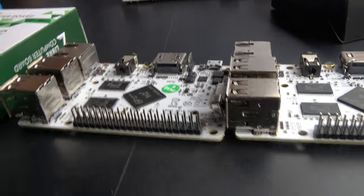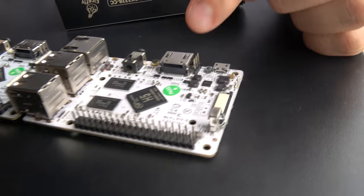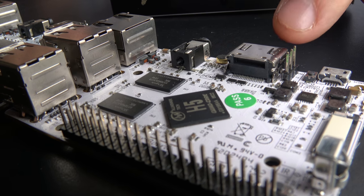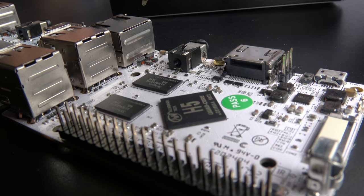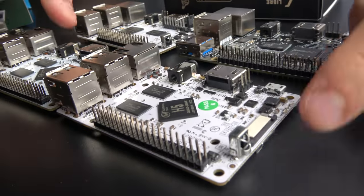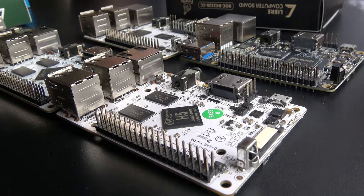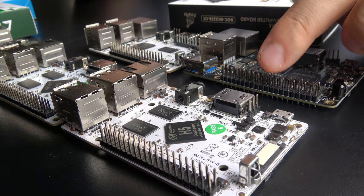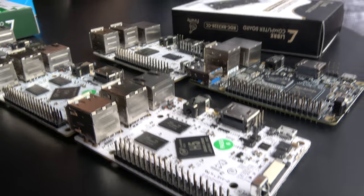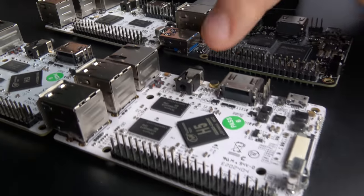Armbian is run by a couple of people in Europe and the US, doing great work bringing ease of use to ARM boards. We have three versions: this is the most expensive with 2GB RAM using the AllWinner H5, a quad-core A53 built on 40nm with a camera interface. The other boards don't have camera interfaces, but they have 4K 60, UHD, H.265, and all the other video features. The H5 only supports HDMI 1.4 while the others support HDMI 2.0.